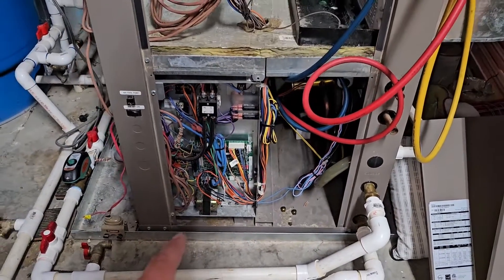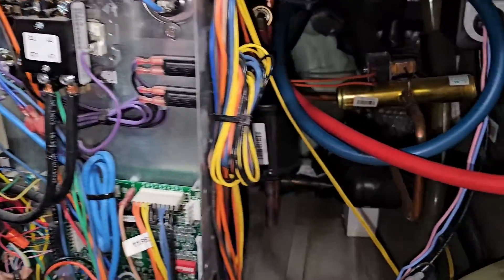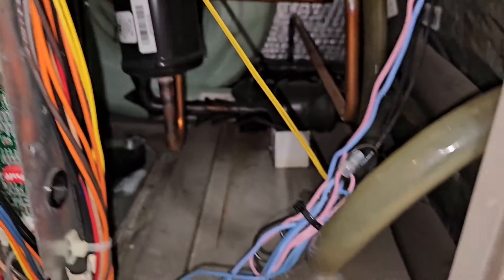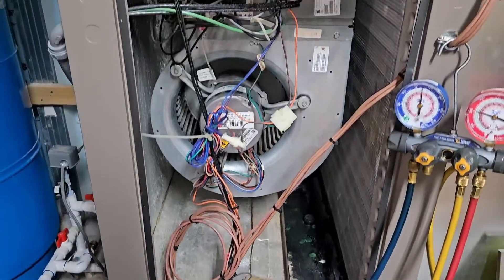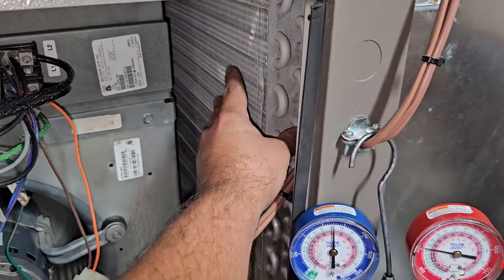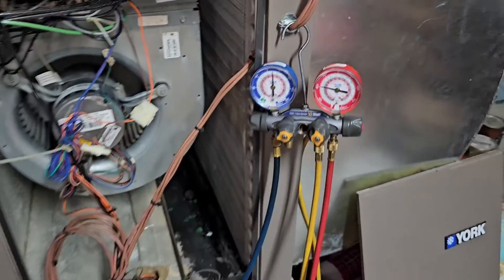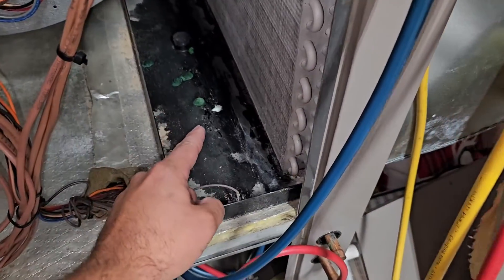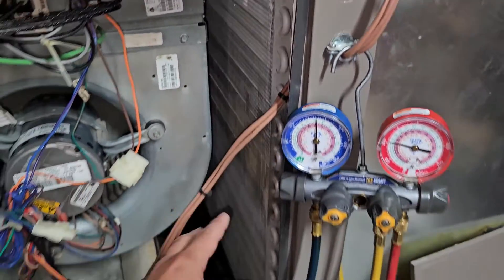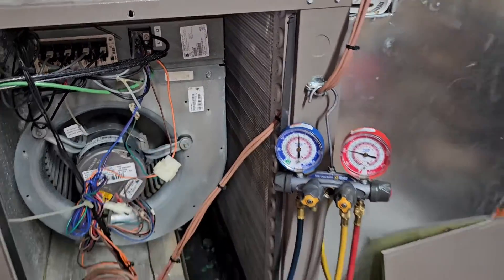If you don't know anything about geo units, you've got open loop and closed loop. This is an open loop — it pulls water from the well, pumps and dumps. The bottom section contains the control board and electrical components. There's the reversing valve — it's a heat pump — compressor to the left, and straight back we've got our coaxial, and below that the filter dryer and thermostatic expansion valve. Up top we've got the indoor blower motor, heat kit above that, and the indoor coil. In cooling mode the indoor coil is the evaporator — low side of the system — it becomes cold. In heating mode, this coil is the condenser and becomes very hot. We're in the cooling season and it's a very slow leak, so I'm checking the pan for oil — running my finger in there. This is my number one spot for checking for leaks because I've had a lot of these coils leak.